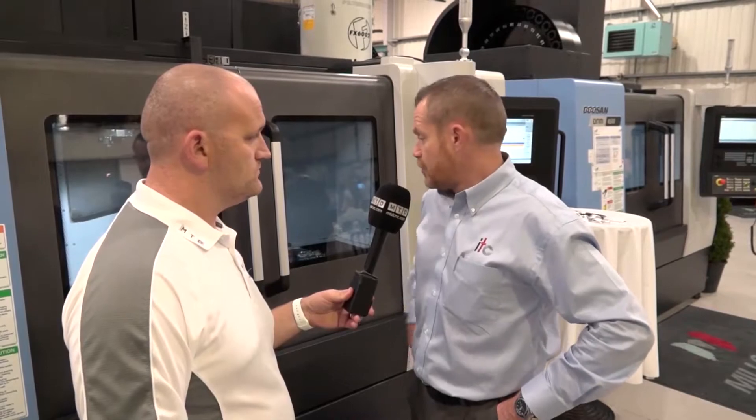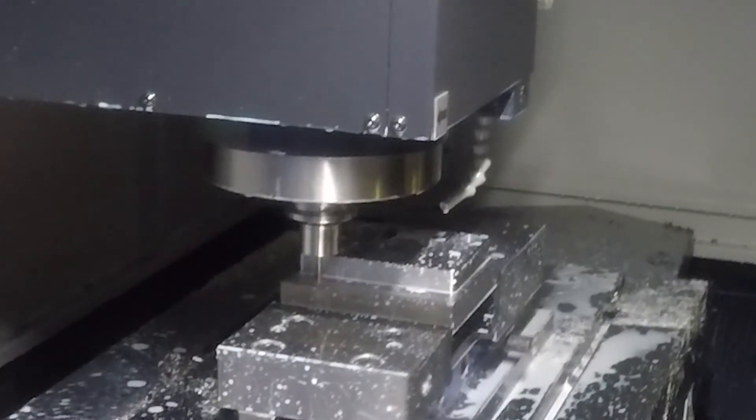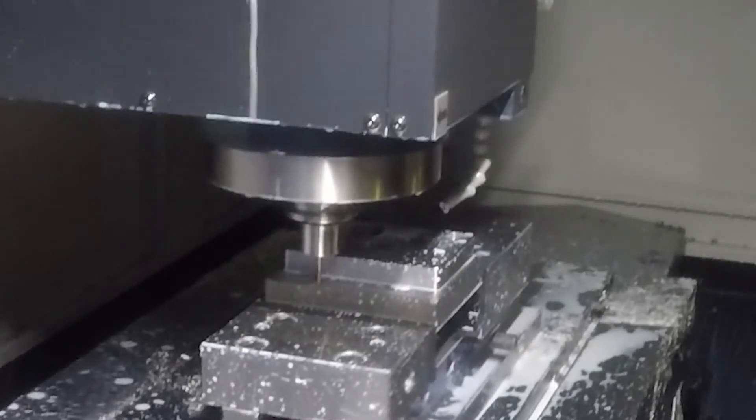We're also demonstrating some of the more unusual big Kaiser products, such as the corner rounding tool, which is an indexable four-fluted corner rounding tool, and each insert actually has four indexes on each, so you can take quite a large corner rounding cut with an indexable cutter.